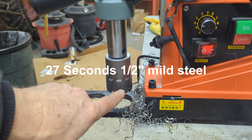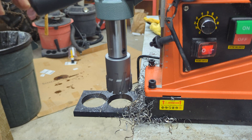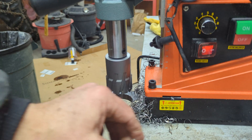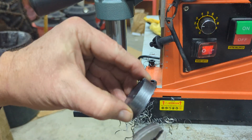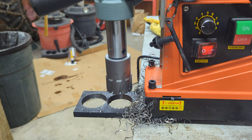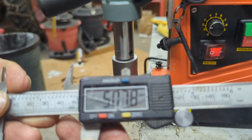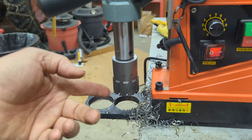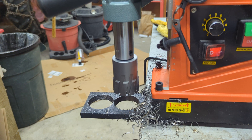Visibly, just looking at this, I could tell that this had a lot less runout than the other bit. This plug looks almost machined compared to the first plug, where you can see a lot more ridges — which I think is indicative of the lower cost bit and the more runout. With the nice bit, I get 50.78 millimeters. Two inches is 50.8, so that's essentially 1.999 inches. That's as close to a two-inch hole as you could get. Wow — the nice bit and this $200 VVOR tool — I'm super impressed by that.